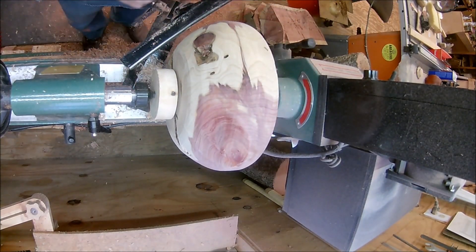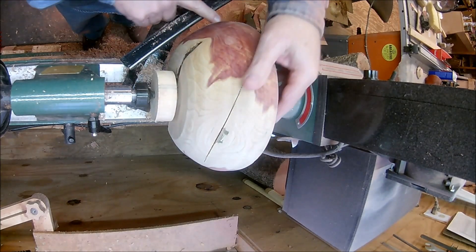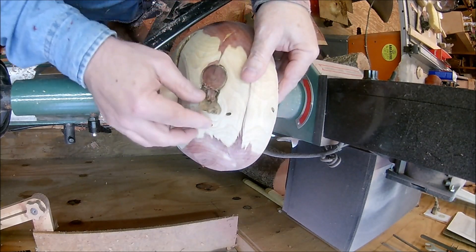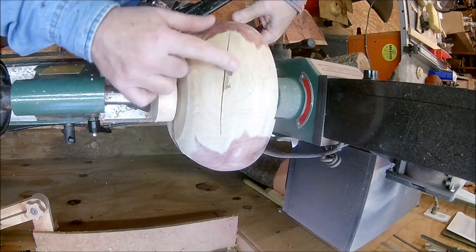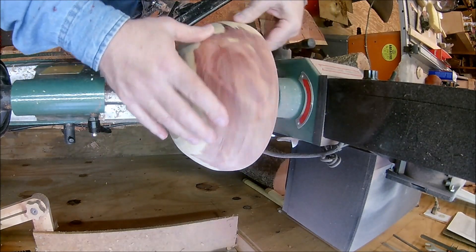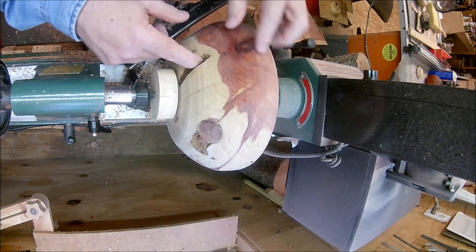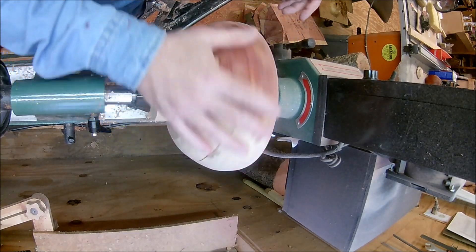I'm not really filming a lot of this because it'd be pretty boring to watch, but what I'm doing is just taking the carbide tool and lightly scraping around here, trying to get rid of some of this stuff. You can see I've still got a little ways to go to get this chamfered down, and this spot here is just about gone — if you remember it was maybe about the size of a quarter. So it's just a slow and steady process; I have to keep stopping and sharpening tools including the carbides, and just trying to be gentle with it to keep the thing from falling apart. I've got a few cracks I'm a little worried about, but I'm just taking it slow and steady and we'll see if I can make it all the way to the end.